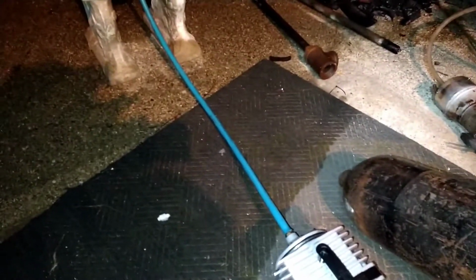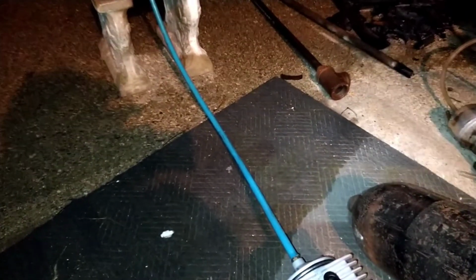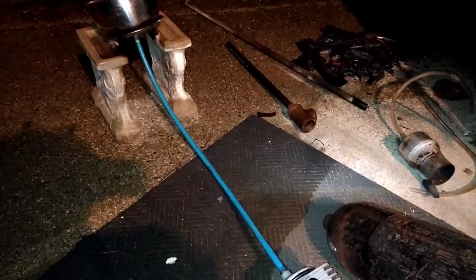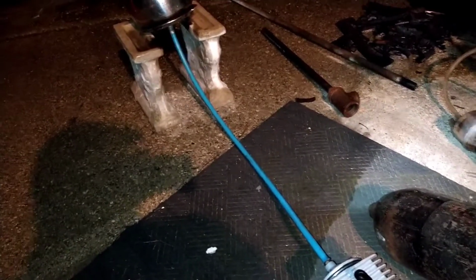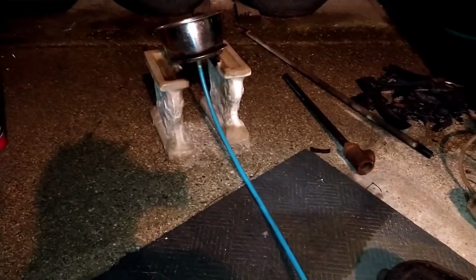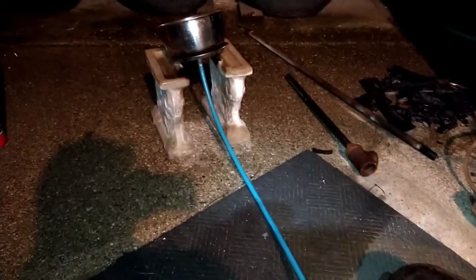And the generator will actually clean up the smoke, besides the filtration, you know, the carbon monoxide, which is a fuel. It's a deadly poisonous fuel, but in the sealed system it's no danger. But it is a deadly poisonous fuel that burns very hot, and in itself burns very clean as long as you ignite it. So what'll happen is, in the engine it'll be burning propane, butane, wood gas is composed of all of those, plus carbon monoxide, which normally isn't a fuel because of its deadly nature, but in this case it is a fuel with wood gas, and we're going to take advantage of it eventually.